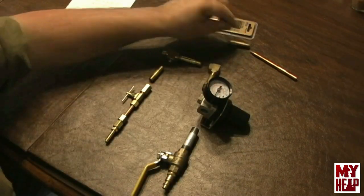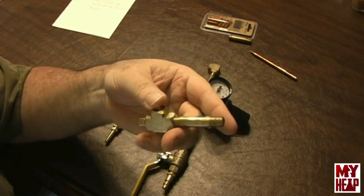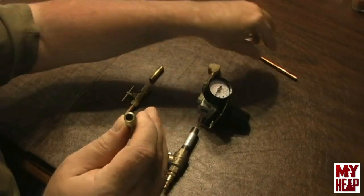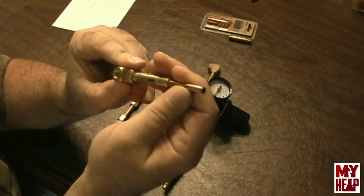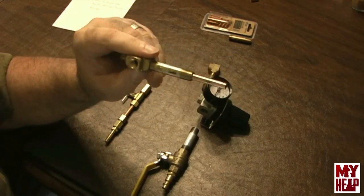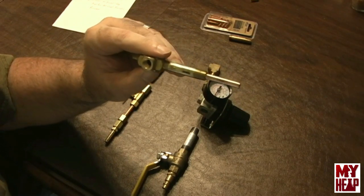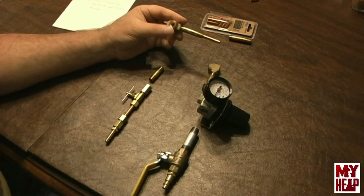What I decided to do was, since I had some half-inch brass stock, I went ahead and turned down the OD for a piece of pipe, threaded both ends to an eighth inch, and drilled it to a quarter-inch ID so that it would fit my tube. That's really the only thing I've done that's a little different from David's, because I couldn't find brass fittings with a heavy enough wall to give me a quarter-inch ID. If you go to make one of these quickie burners, just keep that in mind — you may have to make your own nipple or modify an existing one.